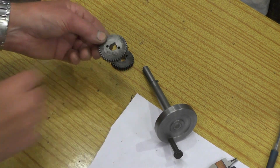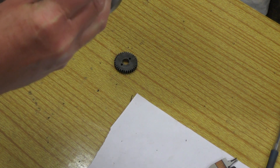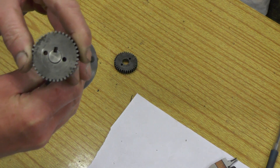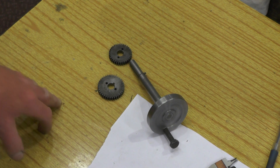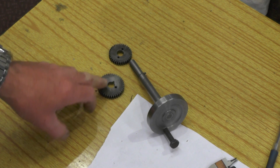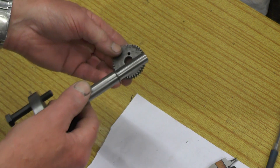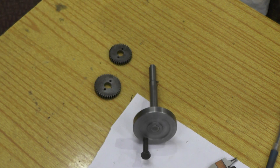That's it then — jobs are going. So that gear is going to fit onto that shaft and I've just got to make a key now to fit that. So that's just a quick tip for any beginners out there. If you've got to do a keyway and not got any other normal equipment to do it with like a broach or a slotting machine, you can do it on your lathe. This is for a project I'm doing at the moment which I'll put up at a later date, so watch out for that. If you've enjoyed that, give me a thumbs up and a subscribe and I'll catch you next video. Thanks for watching, bye for now.